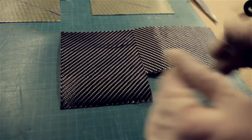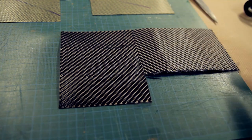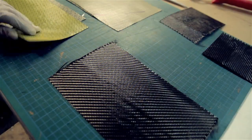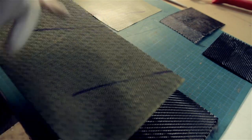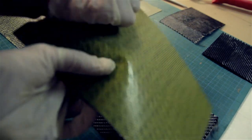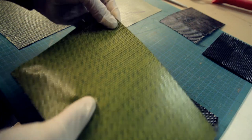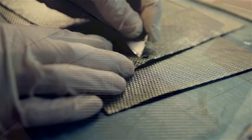Normally you should go the other way, like I'll show you in the next shot. When you just turn the piece of Pre-Preg around — because you can use both sides with Pre-Preg — you can get that V-weave. But you cannot do it with the surface layer because you can only use it on one side.